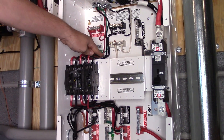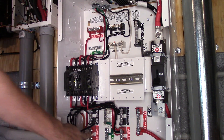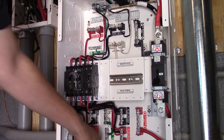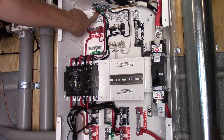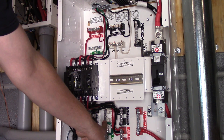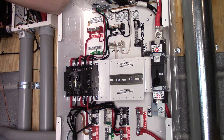I've got the high voltage run from the breaker panel to the inverter. Then from the inverter I've got it ran right here, then it goes down to right here and I've got that tied in. The neutral leg goes right here and then it goes back down to this bar here which is grounded. I've got one ground, and I've got to have another ground right here to here. I've also got grounds that I've got to run through the conduit to here, and a neutral leg I'm not sure if I'm going to use this one or go get another one. I will color code all this stuff with electrical tape so that it's all labeled.